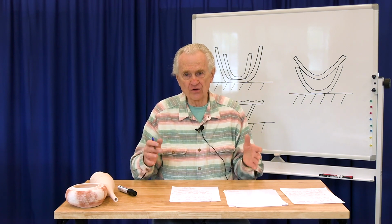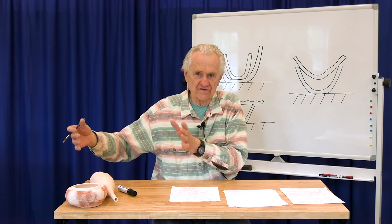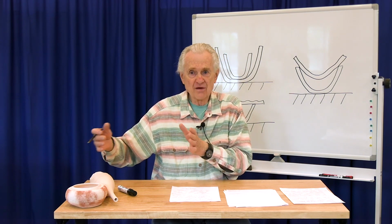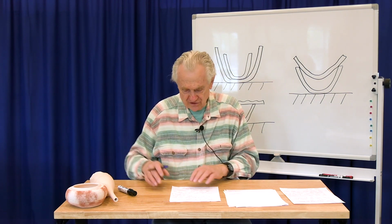By essentially holding for 35 minutes, I am adding the equivalent of another cone to the firing. Because when I put cones in, cone 6 goes down very nicely. But I'm doing that by adding time rather than just adding temperature.